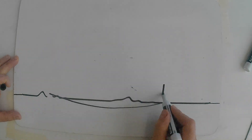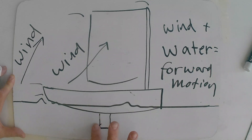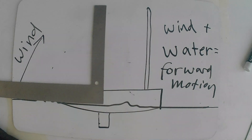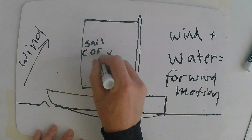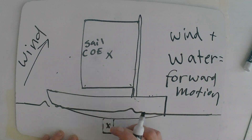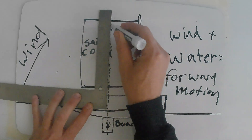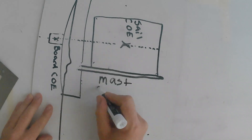Most people draw a side view in pencil to as precise a scale as possible, but for the sake of the video I'm just going to make rough sketches on whiteboards. In short, to sail into the wind the boat has to balance the force of the wind pushing the boat to the side with the force of the water pushing it the other way, so the only net force moves it forward. One way to do this is to find the center of the sail and put it directly vertically over the center of the centerboard. For my simple eight-by-ten-foot tarp sail I can just connect corners to find the midpoint — that's the center of effort of the sail. Same with the dagger board: connect the corners to find its center of effort, then draw a vertical line up from that point, put the sail's center of effort on that line, and now you know where to put the mast.